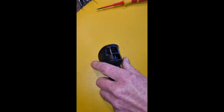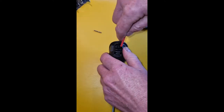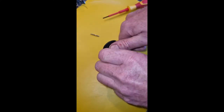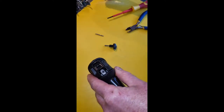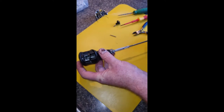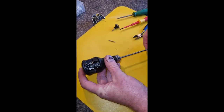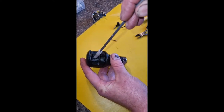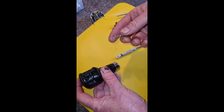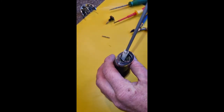Force the pin out. You need to get this black piece out in the middle. See that peg has to go in that hole in there — and that is where the spring should be. There should be a metal spring in there, which is broken and missing. So what you do is get a normal spring and push that down in there.